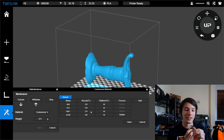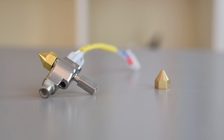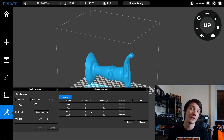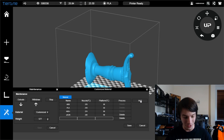Just in case you're wondering how hot you can push the UPs — have a look at the extruder design. This is the hot end on an UP 3D printer: it is an all-metal design with no PTFE tube through it, just metal. That means sometimes printing PLA it can bind up, but it also means this can get very hot. I was talking recently to the guys at 3D Printing Systems, who distribute the UPs around Australia. They tested their UPs to 300 degrees Celsius for a few minutes — they didn't print at that temperature, but they did make it heat up there, which is nuts.